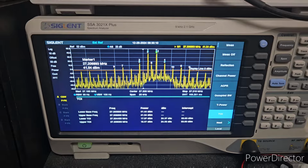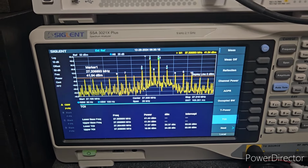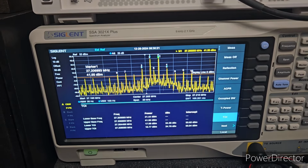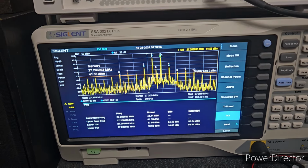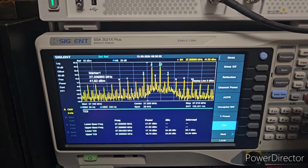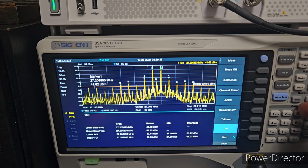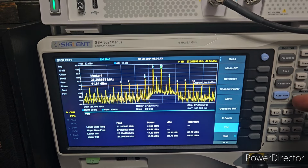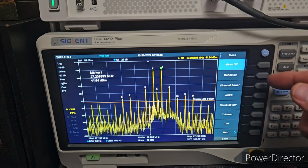So I think when I did the test video under the box stock condition, I think something wasn't properly adjusted when I did the sideband test. But nonetheless, it comes out to be about the same as the QT80 and Quad 6 Pro, about 24 on the third order intercept, which is really good. But I think I was skewed on my measurement or something. I thought I double checked it on that video, but I have to go back and watch it. What I see now is probably going to be more accurate for what the radio is actually doing. So I just wanted to point that out.